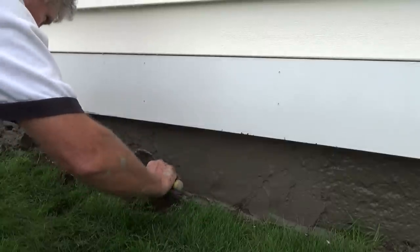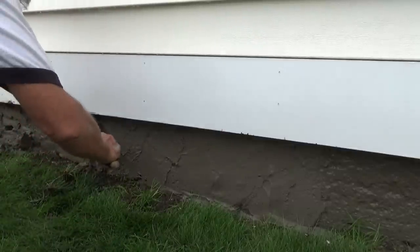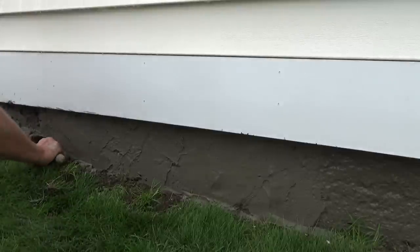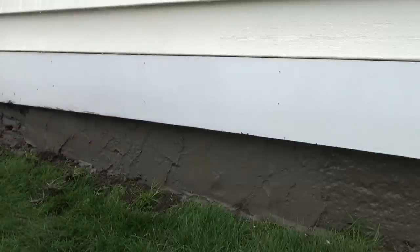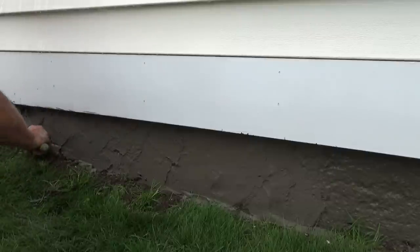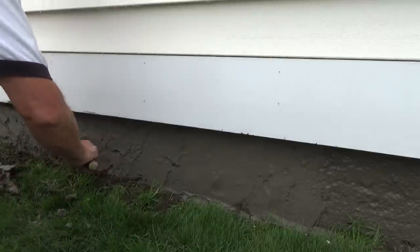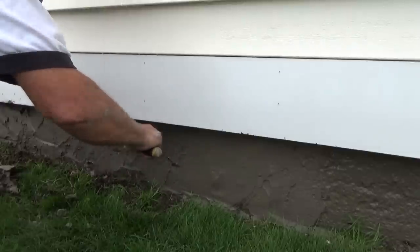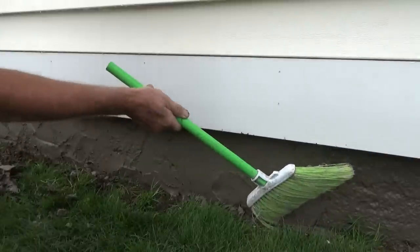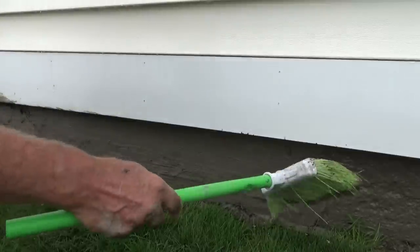Go right over everything. Put this bottom stuff away so the frost don't get under it. Then we're gonna scratch it — just get the broom and scratch it. And then we're gonna come back a few days later and redo the whole thing with a little stucco.